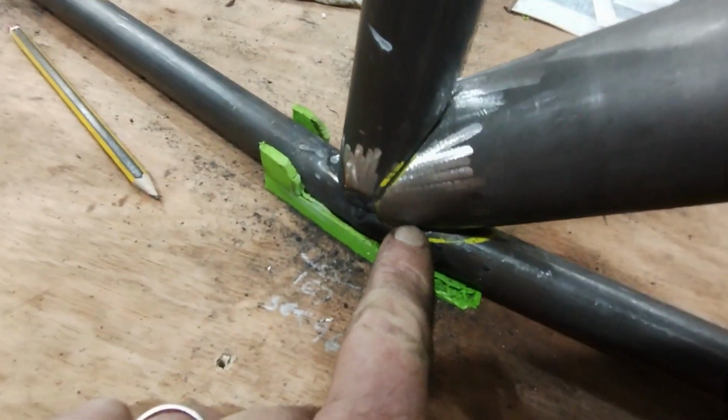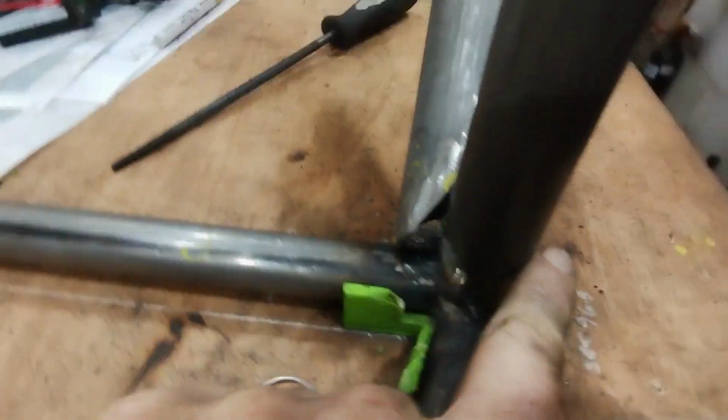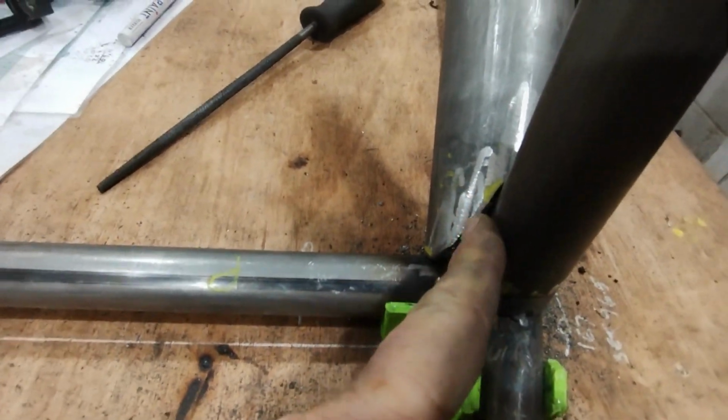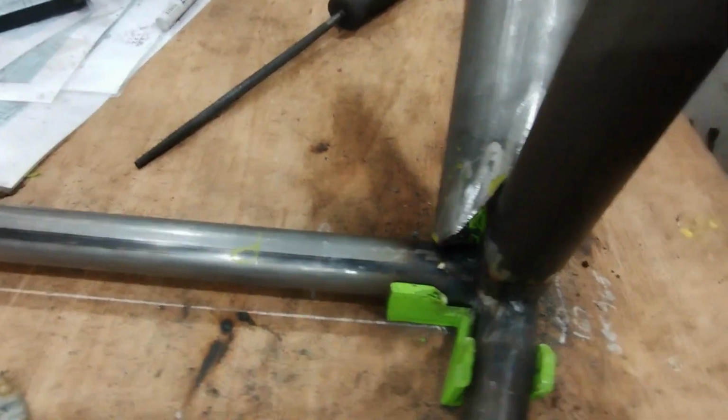After, I don't know, about an hour of flapping around, I got the top and bottom fitting quite nicely. The one error I did make was chopping too much out of that side tube, where I was saying before, obviously the notch needs to be massively offset, but I forgot it basically needed to go straight in there. I need to put in a triangle web gusset in there anyway, so it's not a big deal.